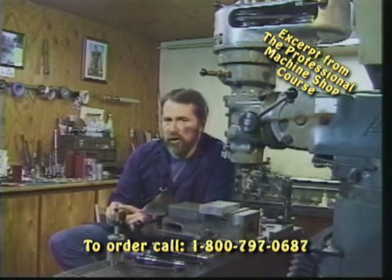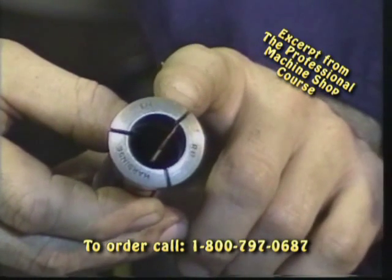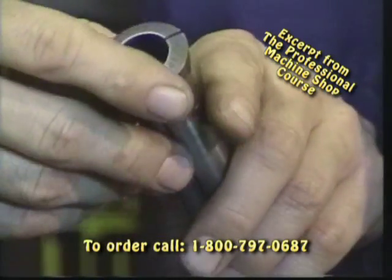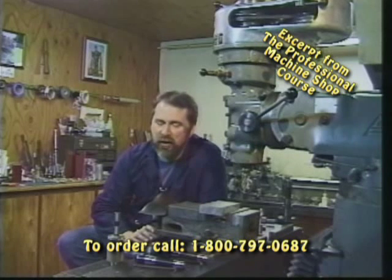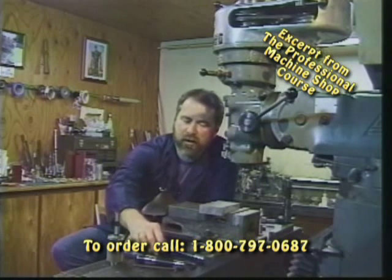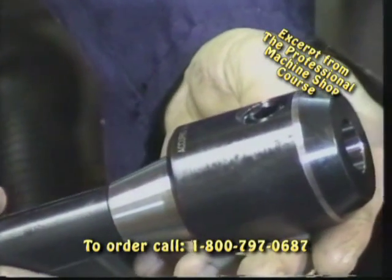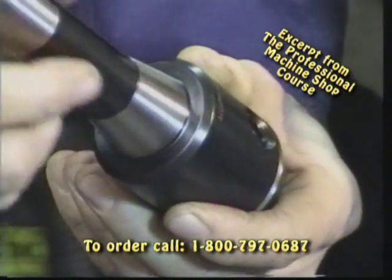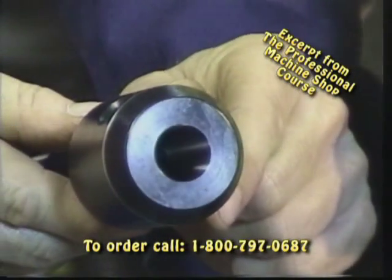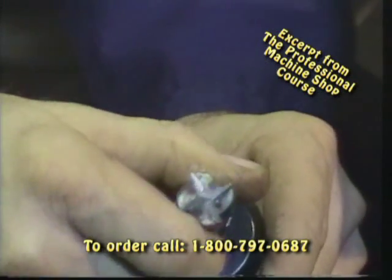Here's another Hardinge in a 3/4 — this is going to take a pretty good size end mill. We'll use this collet if we're doing a lot of roughing material. Some folks feel that the end mill has the potential of slipping in a collet, and they've come up with an interesting concept called a tool holder. This is a very expensive tool holder made by Acupro — a very rigid R8 collet design, machined integral with a heavy boss and a 3/4 inch precision ground hole.